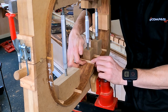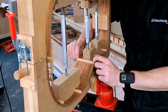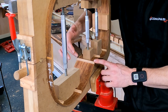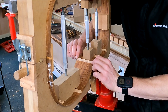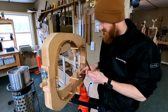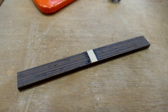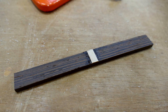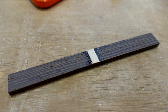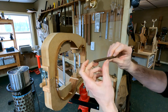You can most of the time fix that gap by simply easing off the clamps a little bit — your clamps do not need to be super tight for a good bond. If they are super tight, you're actually forcing a bow into the workpiece. Most of the time I just back off the clamps slightly and the gap goes away. Occasionally the gap still doesn't go away after backing off, so I made these little cauls. This one is a piece of wenge, but I was just looking through my scrap bin for something hard yet somewhat flexible.